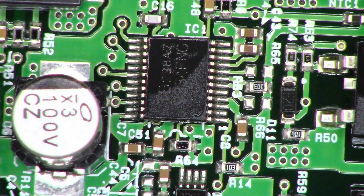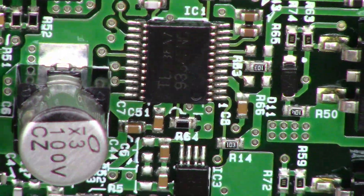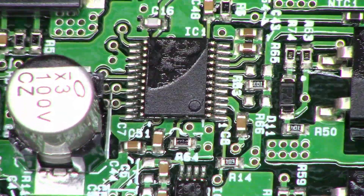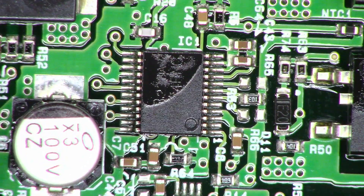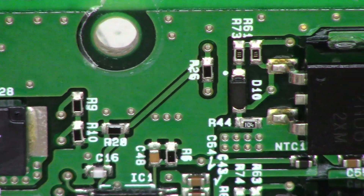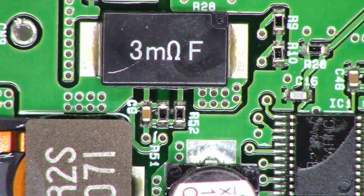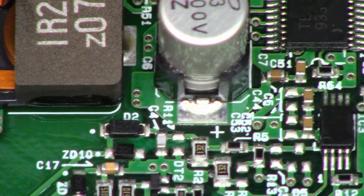What is that? TB238A7 maybe — TB looks like 238A7. No resistor numbers on those guys right there. Three milliohm — once again a current limiting resistor, so it knows if it's drawing too much current, like I'm sure this one did.